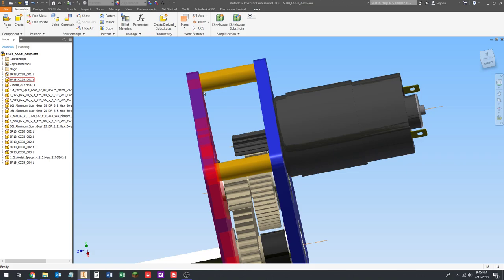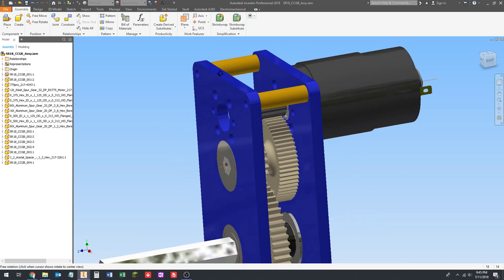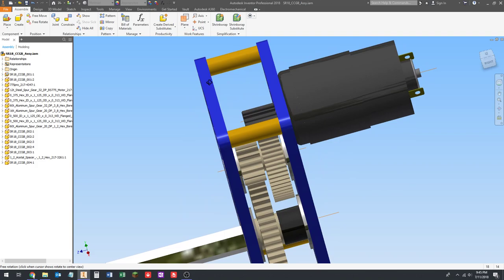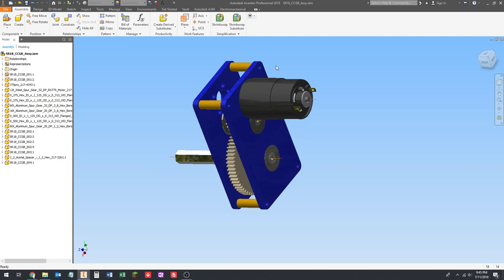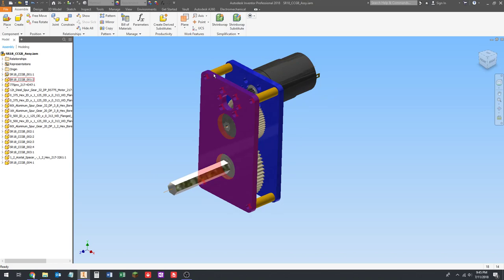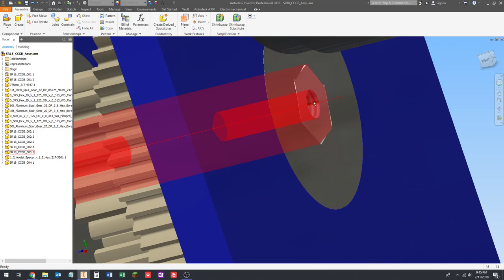So we're going to use button heads for this. You could use socket heads. Socket heads are a little stronger in terms of the hex drive in the screw is a little less likely to strip out, which is an issue with button heads. But button heads are lower profile, they don't stick out as far, and they just look nicer. So I think maybe on a real robot we'd probably use socket heads just because we have a lot more socket heads laying around. But for the purpose of this, we're just going to use button heads because it'll look nicer. And then for holding shafts in, you're not going to torque these screws down a whole bunch, so I pretty much always use button heads on the end of the shafts, if I have a choice. So that's pretty common practice. Most teams do that too.